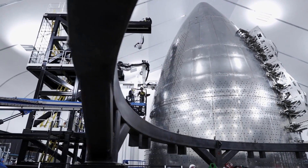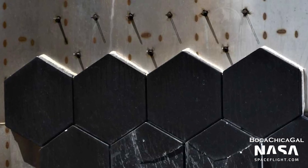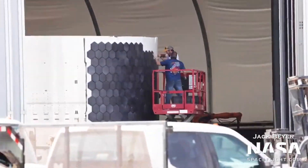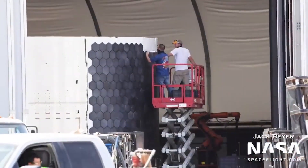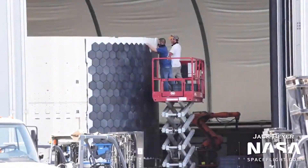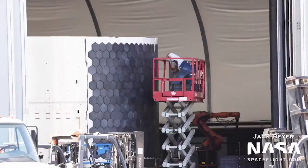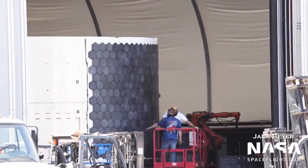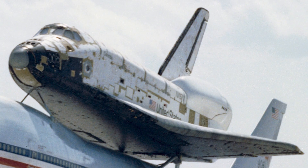Each of Starship's hexagonal tiles is mounted onto three steel studs, which are robotically welded onto the sides of the vehicle. Before the tiles are installed, a thick white fabric is installed as a base layer to provide extra thermal protection. From there, the individual tiles are attached by hand. This method of attachment is very different and much simpler than that of the shuttle. The space shuttle's tiles were applied using an adhesive, sort of like a glue. This method of application was not perfect, as NASA engineers learned in 1979 when Space Shuttle Columbia lost thousands of tiles during its delivery transport to the Kennedy Space Center.